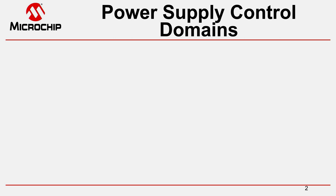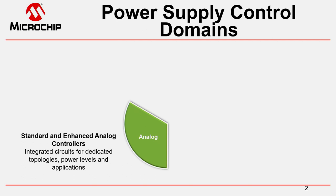When we look into the world of switch mode power supply controllers, the majority are pure analog circuits — highly integrated circuits for dedicated topologies, power levels, and applications. There are devices with integrated MOSFET drivers and auxiliary power supplies, which we usually refer to as switching regulators. There are also more discrete versions, which we call PWM controllers. PWM controllers in general allow you to better scale the controller to your application needs, so you can pick external MOSFET drivers and design over a wider range of power and voltages.